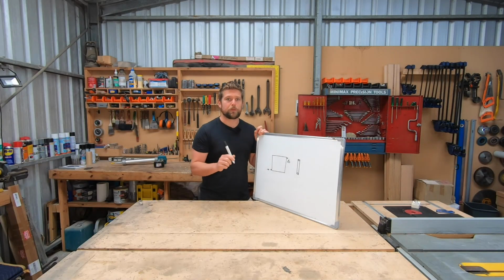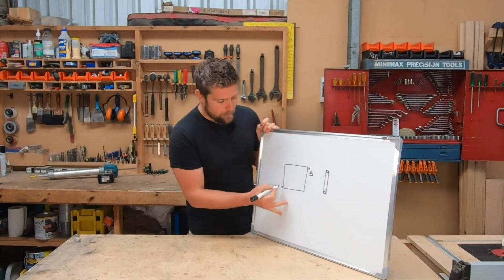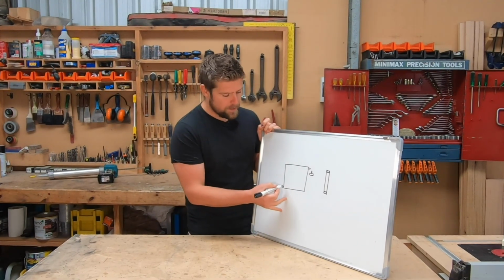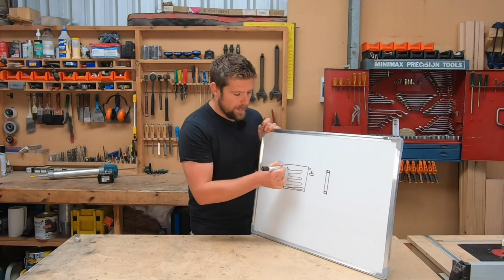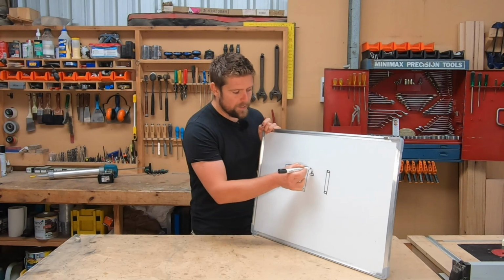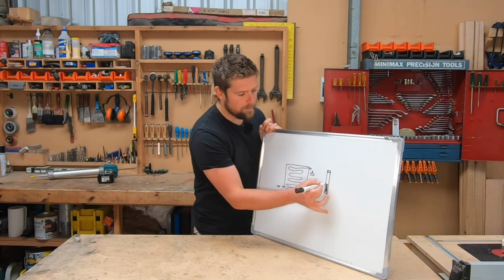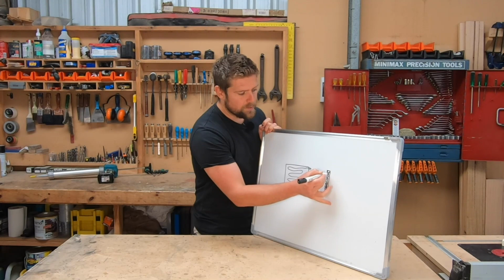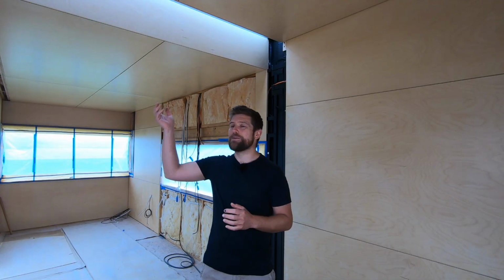So before we finish up, I thought I'd just point out one thing, and that is if you want to do a vertical window, which is a more common type of window than the horizontal one I did, you could do the same thing by putting a valve at the bottom here, slowly pumping in the argon until it comes out the top there. So if you look at the cross section, you'd be pumping in the bottom, slowly building up till it comes out the top and fills the inside cavity there with an inert gas. So that's the double glazed window.